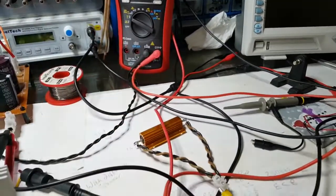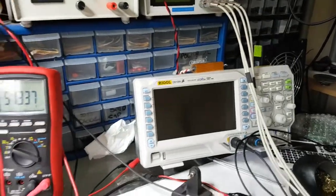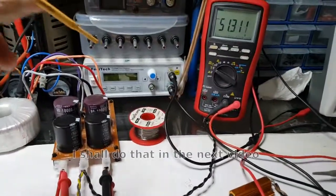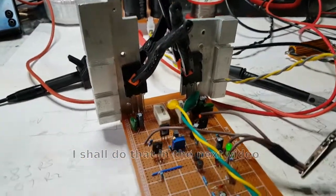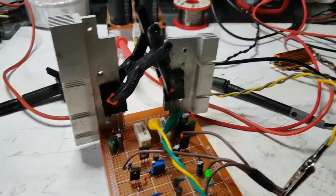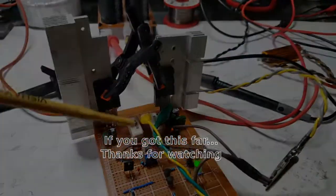And that shouldn't be really getting warm at all because I haven't got a signal going into it. But that's great because now I can hook up the oscilloscope and start putting in a signal. Now we can see what we can get out of this on power just by itself, on that transformer by itself, and then I'm going to do the same thing. I'm going to hook them both up. I'm going to get this tweaked up to 70 volts.